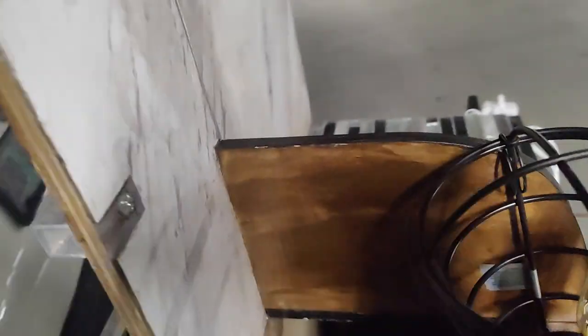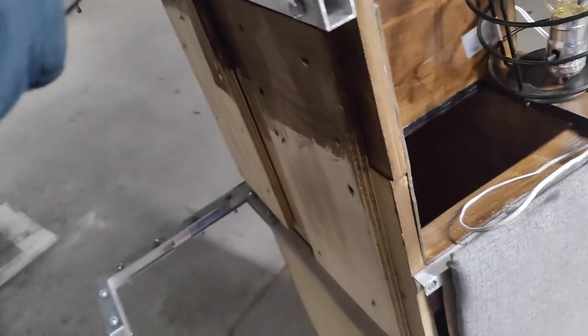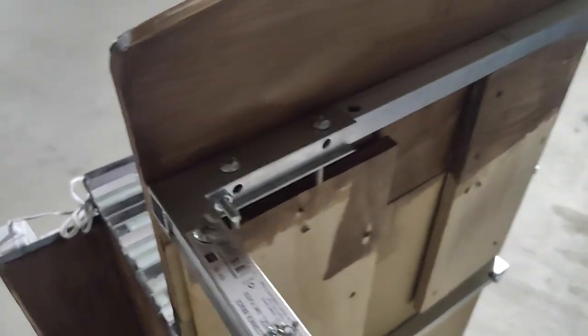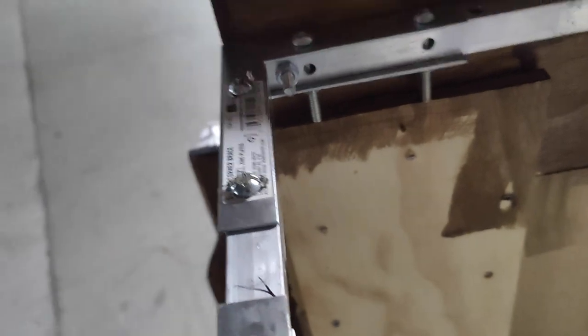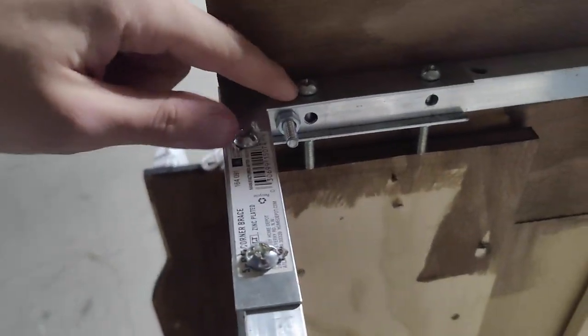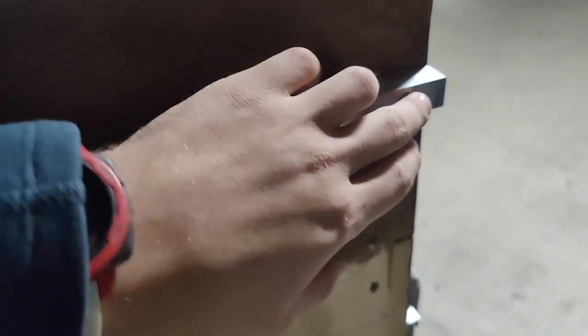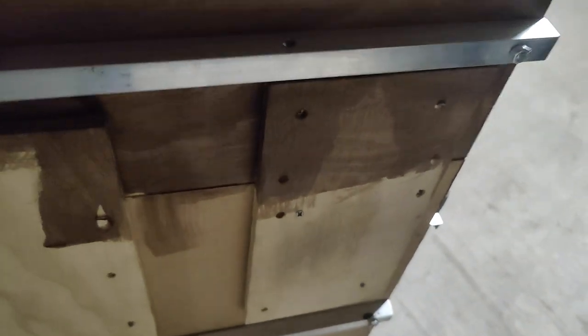For the construction of this part, like most things, it's half-inch ply. I had to connect these two pieces together and reinforce that a little extra. It's stained with a decent stain. These aluminum parts are the most important — just square aluminum tubing with steel angle brackets. I cut these with my jigsaw and drilled holes with a standard drill bit. Getting these angles right was a little difficult; these holes had to be expanded, and drilling into metal it's really hard to keep the drill bit stable. I also had a few variations swapping out some bolts because they took up room where the crash pad slides in and became a block.